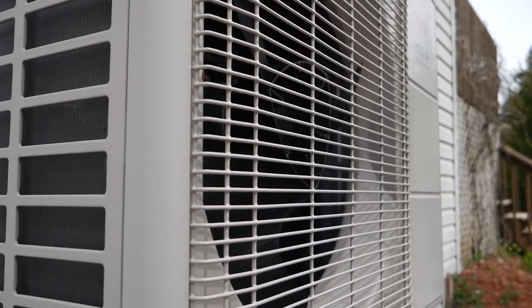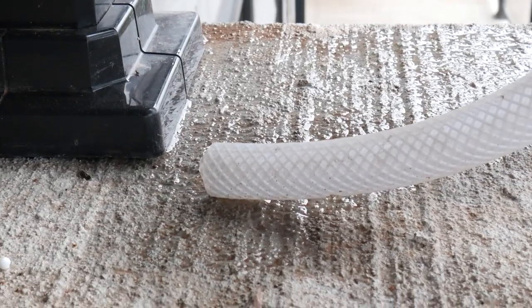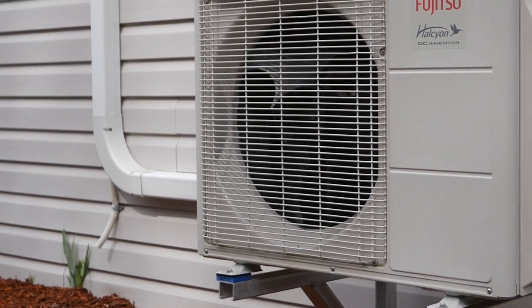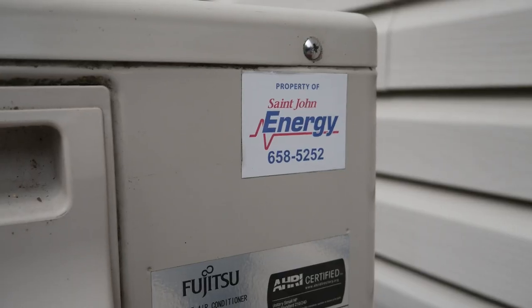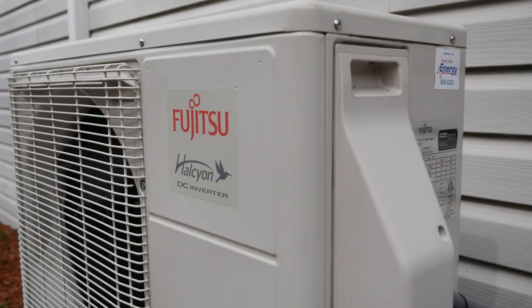Special note: if you do see ice, frost, and snow buildup in the coil, that is completely normal. Don't try to chip or remove that ice — that could damage the coils and void your warranty. Additionally, make sure that there are no obstructions in the condensate drain. This is the tube through which water or condensation from the inside head is removed to the outside environment. Having an obstruction or blockage can back the water up into the home and lead to water damage.